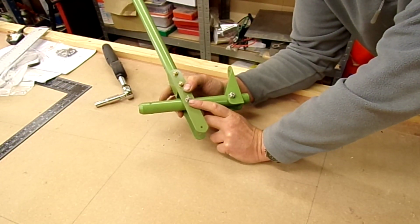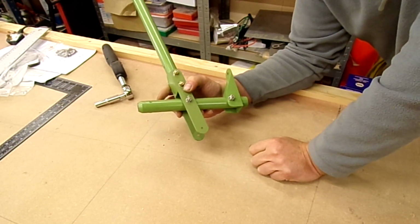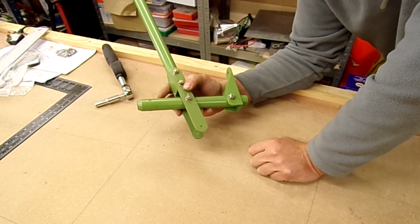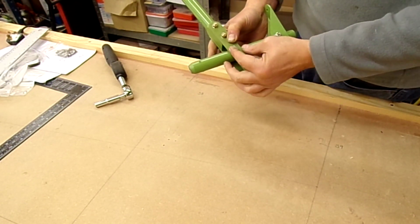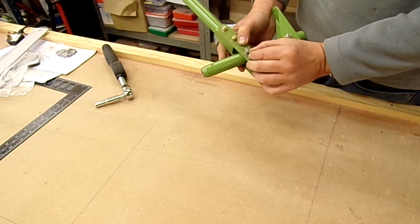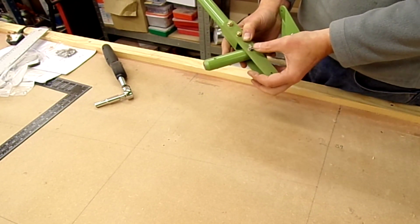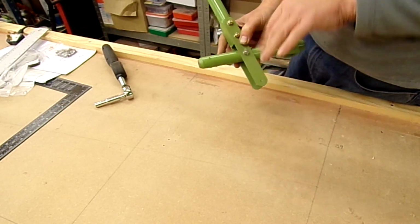There's a split pin in. As you can see, I tuck the ends in. It's not a requirement in any of the aircraft publications really, but it's how I was trained. It means that there's nothing to catch, especially as this is in the cockpit, so you just cut them off and tuck the ends of the split pin in. That's the way I was taught. It also stops the split pin from being able to shake and rattle and roll in there.